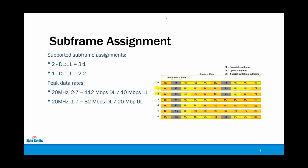But basically, that equals better non-line of sight penetration too, just because of the different techniques that it's using on the uplink. It sacrifices throughput, but that's why you're getting so much better non-line of sight as well, because of the nature of how it's doing the uplink.